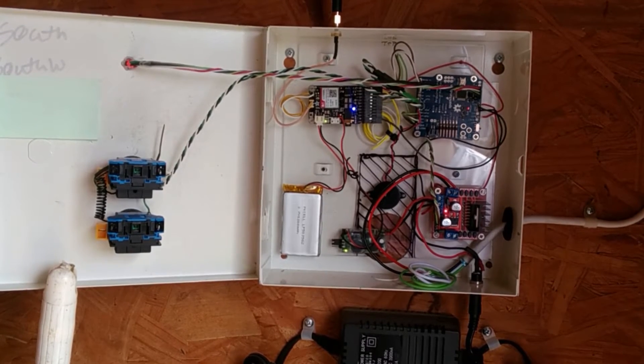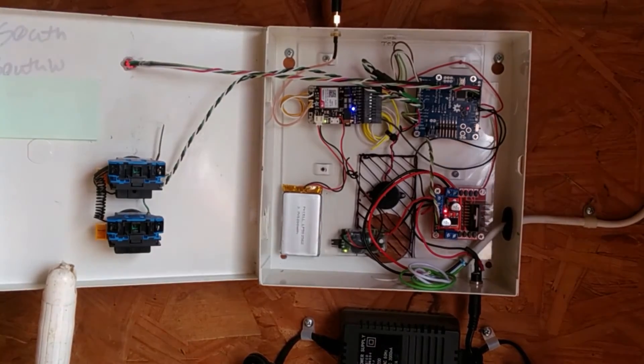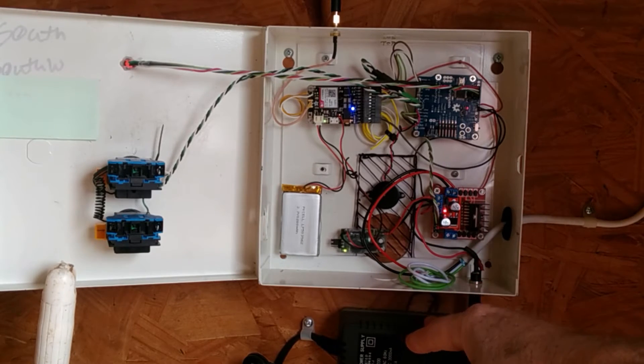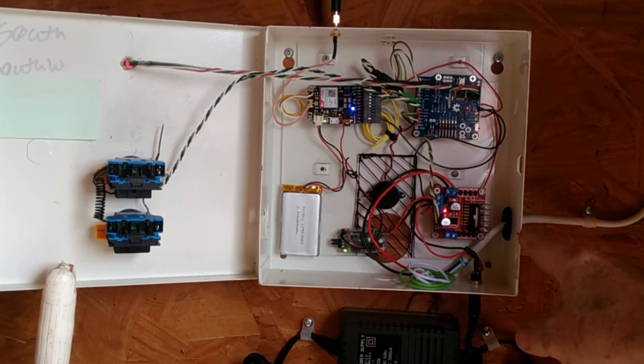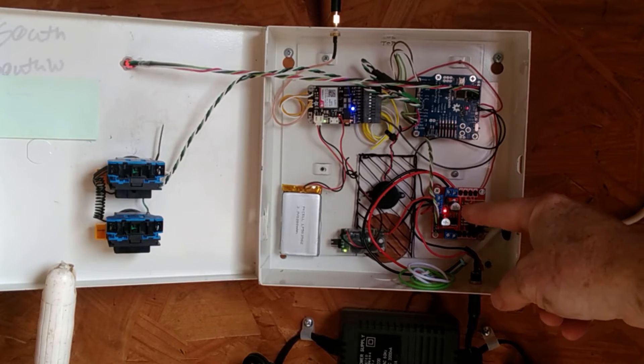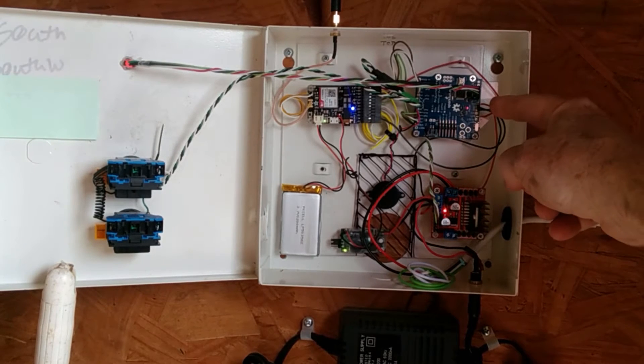With the help of a broom handle we've got the door held open. This is the inside. Over here on the left are the two push buttons we could see from the outside — really nice push buttons I found at an electronic surplus store for cheap. We've got our power supply down below, which feeds two components: it feeds the H-bridge, which also has a five-volt regulator.